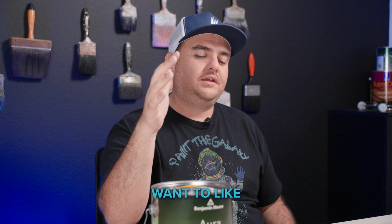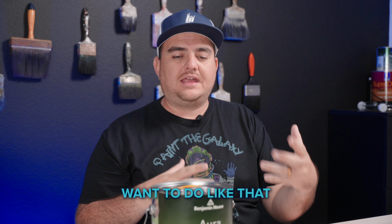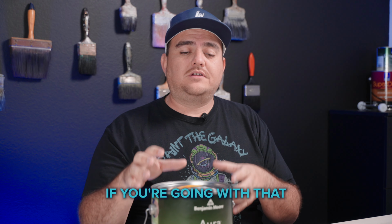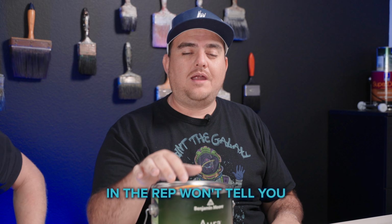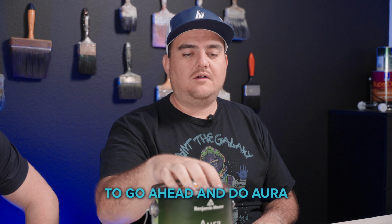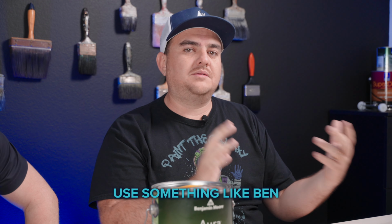The other thing you can do is, if you're painting your own home, a lot of you out there want that modern Chip and Joanna Gaines white and black look. If you're going with that, a thing you can do to save money, and the rep won't tell you because they want you to buy all Aura, is use Aura on all the dark color. So if you're doing black accents or black trims, that's probably where you want to use Aura, and then you could use something like Ben on all the white.